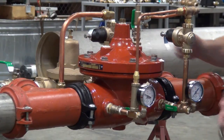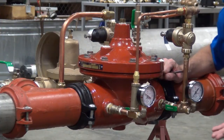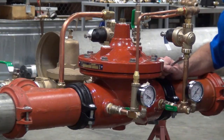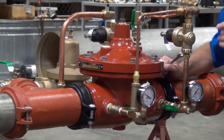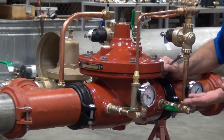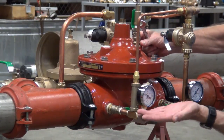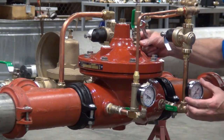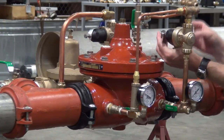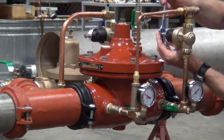That 50 gpm threshold is where the valve wants to operate correctly. So we opened up a little bit of flow downstream and gave the pilot just a little bit of a turn to initiate flow through the assembly. We've got our closing speed control in the full open position, and I started with the opening speed control three full turns open from fully seated. With a pressure-reducing valve, we want it to open not too quickly because we can send a surge downstream. Conversely, when the flow rate downstream ceases, we want it to close fairly rapidly — but not so rapidly that it develops a water hammer. Now I'm slowly turning the pilot adjustment bolt inward to increase the downstream pressure, with a flow rate greater than 50 gallons per minute through this valve.